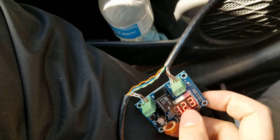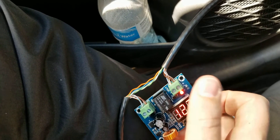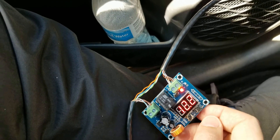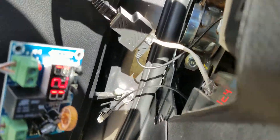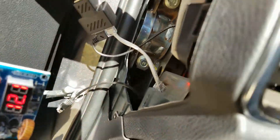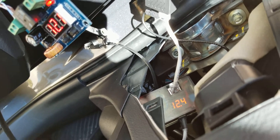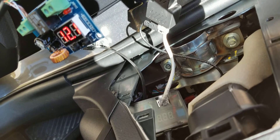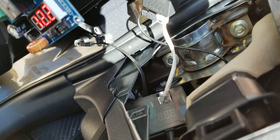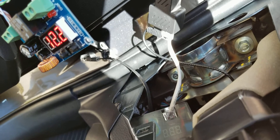I've got it set to 12 volts, so when the voltage hits 12.0 that light will turn off because it'll disconnect power, and then the ZSS and the Panda will turn off too. We're getting pretty close to that point — let's get them both in frame. Yep, it just hit the relay. The relay turned off, the ZSS turned off, the Panda turned off. And because there's no longer that extra draw, now the voltage goes up a tiny bit — that's why you have this hysteresis value.